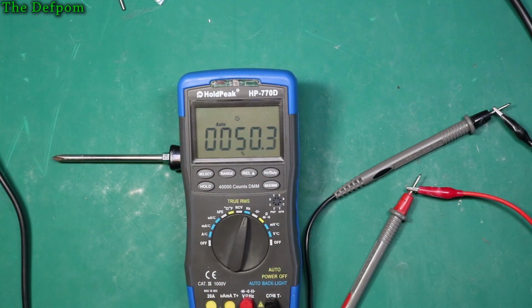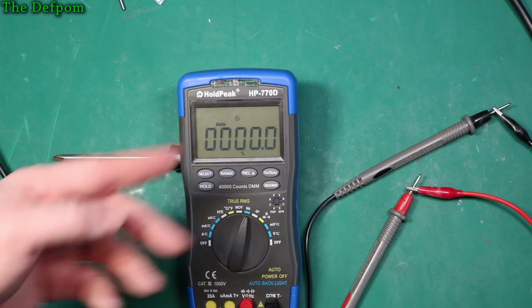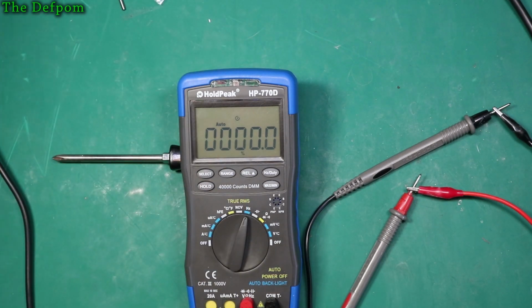Duty cycle. Yeah, 50%, that's fine, because I'm doing a sine wave right now, so that should be absolutely right. Now a square wave, and we'll see about changing the duty cycle on a square wave and check the accuracy on that as well. This is currently 4.7 kilohertz, which might be a bit high for a square wave actually. 20% duty cycle is what's on now. Can't see it. Voltage 1 volt, let's go 2 volts. There we go, that's better.